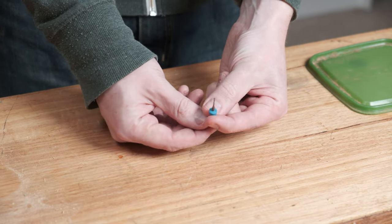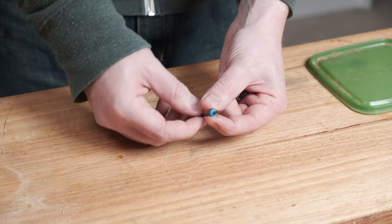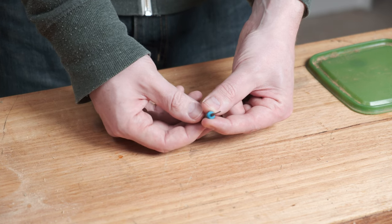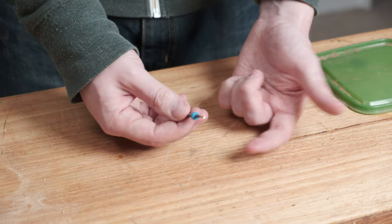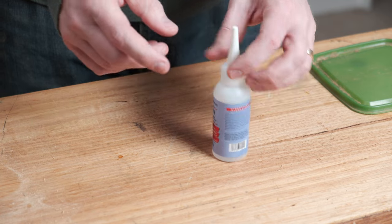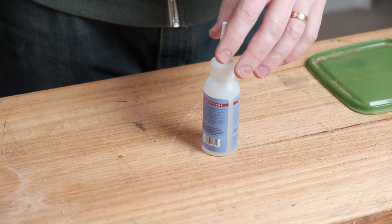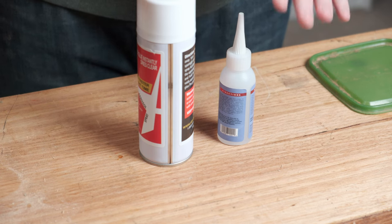You'll also want a very small end mill or router bit — this is a 1/16th of an inch, or about 1.5 millimeter bit. The detail you can get in the pocket you carve out is limited by the diameter of the router bit, so I can get down to 1.5 millimeter detail. A quarter-inch or 6.35 millimeter bit would be too bulky for fine detail. You'll also want some superglue, preferably a couple of different viscosities — thin and thick. The thin is for wicking down between gaps with finer stones; the thick so it doesn't absorb too quickly. Ideally use a spray activator so that when you're ready for it to set, it sets.